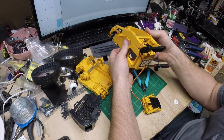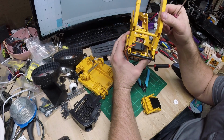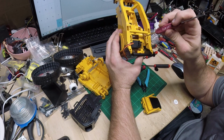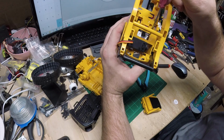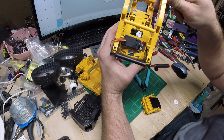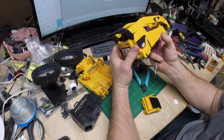We'll get that servo about right in there, get a servo horn hooked to this, maybe we'll go a rod right up to this point and up and down. That certainly makes the most sense to me. Servo horn coming off here, trim this out to the side so you can get a better view. I'll probably end up trimming this out to the side, horn coming off, and then hooking to this and using that to raise it and lower it. That makes just a little bit more sense. So we'll see. Nothing's decided yet.